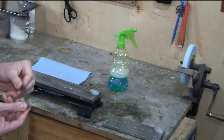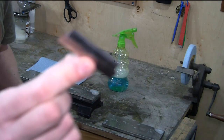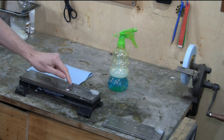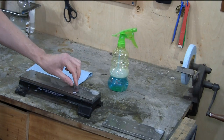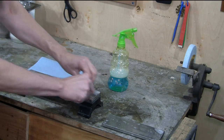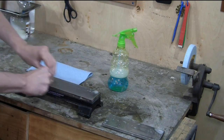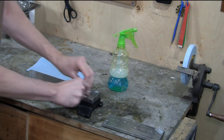The low-angle blade is even easier because it's even smaller. Look at the width of the bevel — it's almost equal to the flat on here. If I set this on my stone and push it up, the surface tension of the stone and the Windex on there is practically holding it at that bevel angle. It's just ridiculous — this is even easier. Veritas, when you buy that shave, I believe they even have a little attachment that allows you to hone it. The low-angle shaves I feel are a great entry into spokeshaves — it is the most versatile shave.